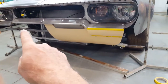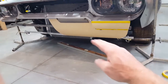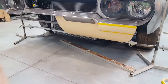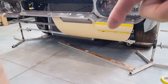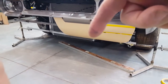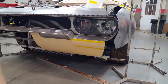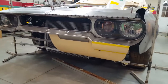That's where I established the upper bar, which is the permanent bar. This portion is smaller and it relates to the pan and the roll of the pan and how the pan intersects with the lower portion of the bumper. This area right here has to be smaller in height than the area farther out — there'll be a little transition — and then it goes straight across. There's also a grill opening down here that'll have to be determined, and two pockets for fog lights, but that can come later. Right now I'm just trying to deal with the proportions — seeing how the general look is coming together, whether it's looking too fat, too wide, or too tall.